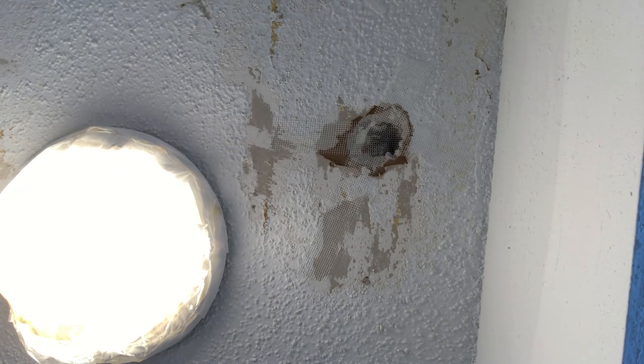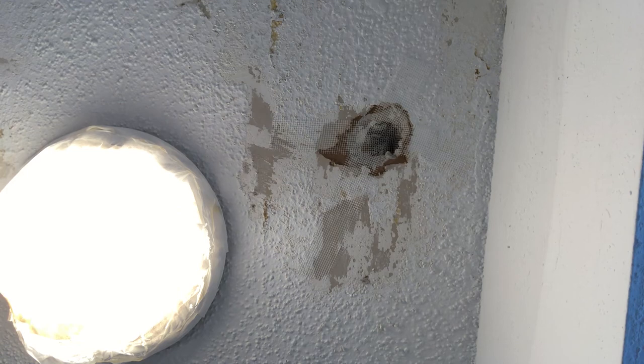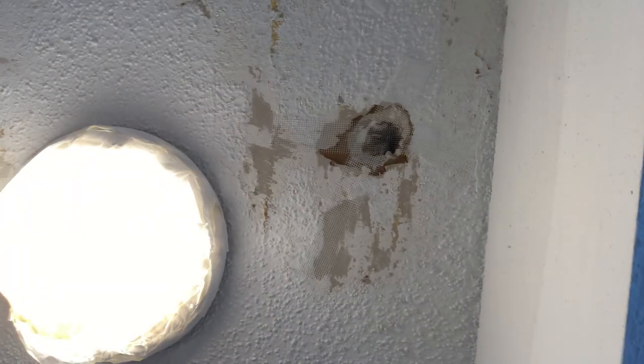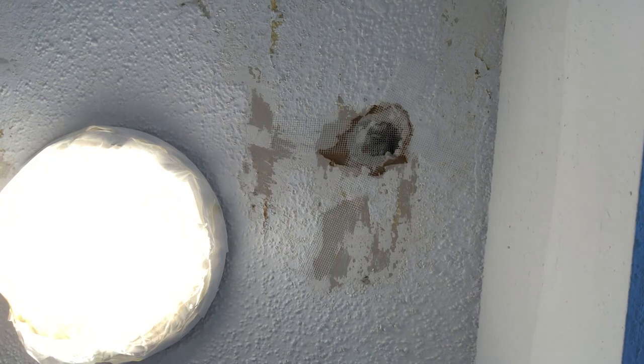This is really common sense if you think about it — the plaster has to be thin enough to go into that hole and grip into those little mesh crevices. See those little mesh crevices there? So your plaster has to be kind of thin. I just want to show you the mixture, how loose it is. See it dripping like that? That would be great if we were working on a wall, but on a ceiling it's going to fall out.